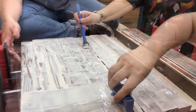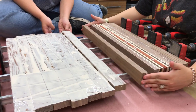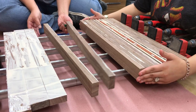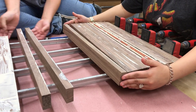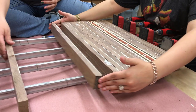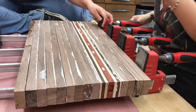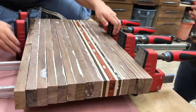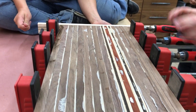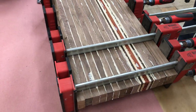Titebond 3 is the very best glue you can use for a cutting board. It has the highest bonding strength and it is the most waterproof of the Titebond glues. I know Titebond 2 says cutting boards are a recommended use, but since Titebond 3 is more waterproof, I always choose that — in fact, for all of my projects I use Titebond 3. It has the highest viscosity so it runs a little bit less, it has the longest open time, and it has the highest bond strength of the three.